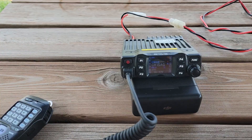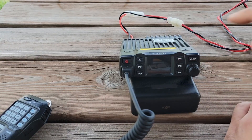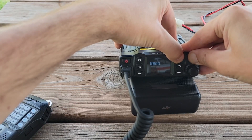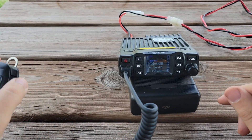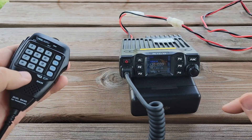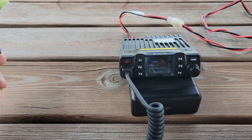I think this is a software thing. I'm going to unplug the power to disconnect it. I want to hold down the Function and P4 button while it powers up. Function and P4 pressed, and that gets us into test mode. Now we're in test mode. PTT doesn't work, up and down doesn't work. We can see firmware is 1.10. The AB button works here.